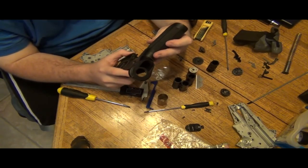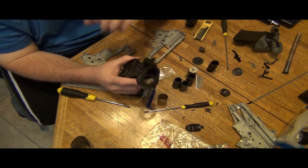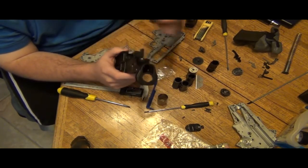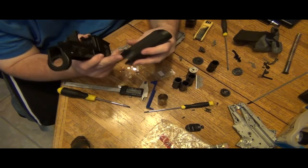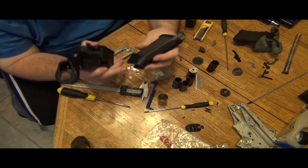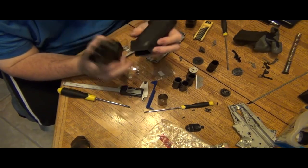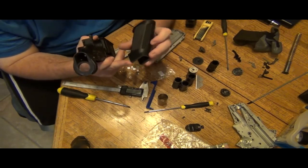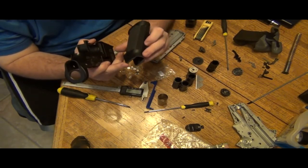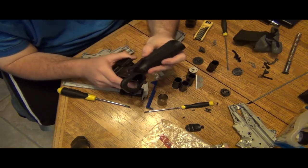So the way you do this is you have the gearbox shell in here and you pin it in so that it's in there good and straight. And you put this on and you sand the top very slightly, just keep going, and the edge here, and then this side too. So it fits in there because it's basically taking more material from the top, but some from the edge here and a little bit from the front, so that it comes down in there.